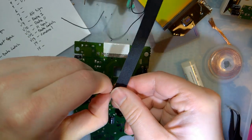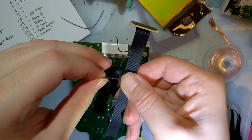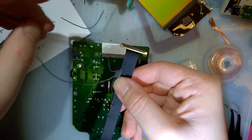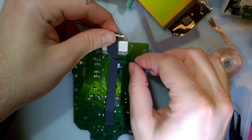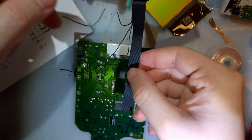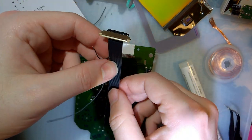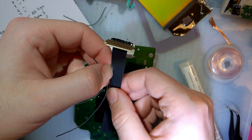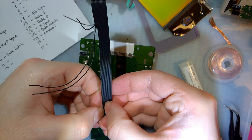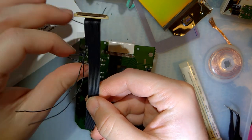Next is data latch, which goes right next to control. So these two are going to go up and over like that. H-sync. All of these go on this connector. These are, yep. Probably should be soldering these. Let me at least separate these lines.